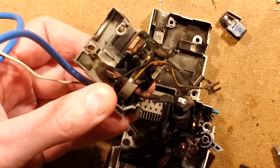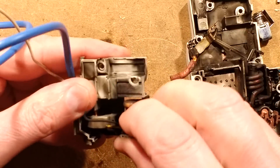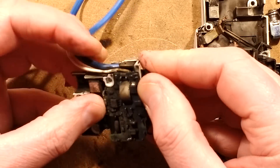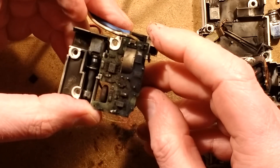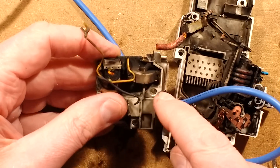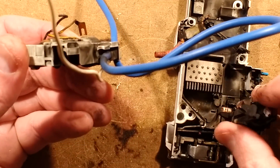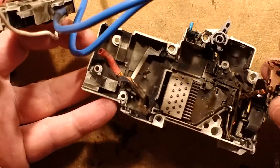I'm just going to cut this module out. Here is the sensing circuit, which looks almost glued in. John Ward also took one apart and it had blown up inside as well. Initially I thought maybe the test resistor has failed in it, because if you wire these in the wrong way round and press the test button — there's a little coil here — normally it measures the live current flowing through and then the return current flowing back. The neutral wire comes through that coil and goes out to a terminal, ultimately leading down to the output.